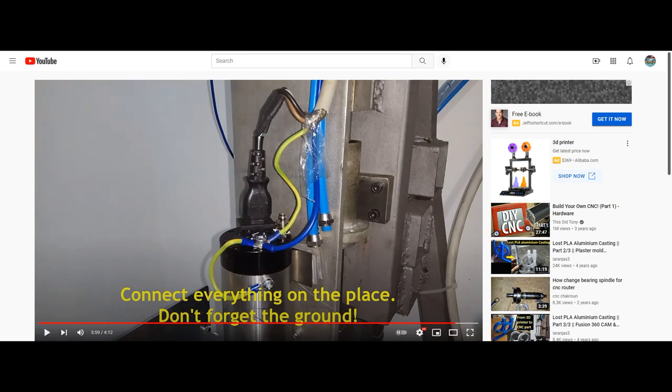Here's another point. He's got a ground coming from the cable where it's attached to the shield drain with all this crap sticking out, which is all his tin braided copper. It comes in here to a lug, and then it splits. You have a ground here and then a ground here. And what he doesn't realize is being these are all crimp connectors, the resistance just keeps growing.